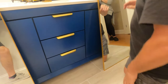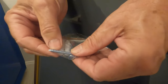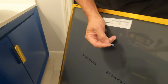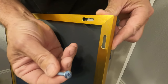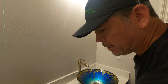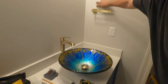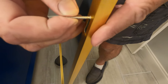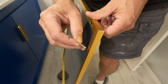Ready for the mirrors? Here are our mirrors and the hardware on the back. Check this out — take a screw out of here. This is from the factory. Look at this keyhole slot they give you — there's nowhere that screw is ever going to go in there. That's why things take forever. Fortunately, we had some screws left over from this hardware since we screwed into blocking, so we didn't need the factory hardware. And this actually fits in there perfectly.